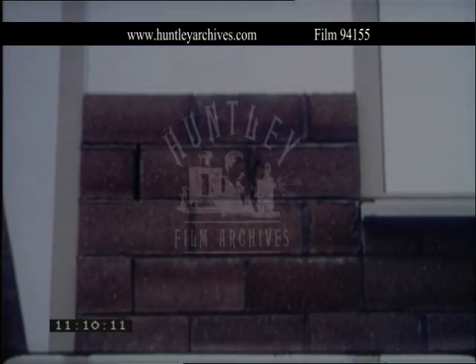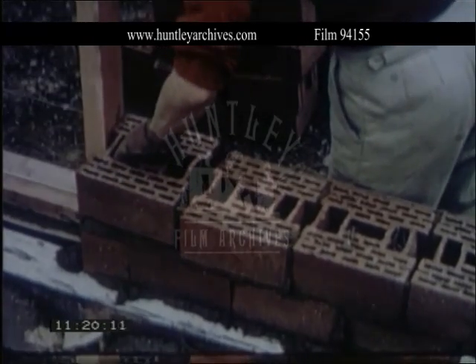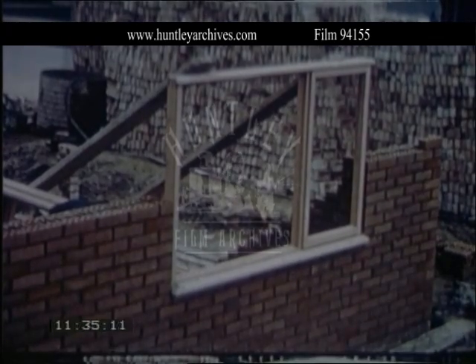Windows and doors were spaced at brick dimensions, using half bricks to complete the reveals. The bricklayers did not have to stop to cut the bricks, and time and materials were saved. This careful planning of walls and openings to brick dimensions is desirable with ordinary bricks to avoid wasteful cutting, but with V-5 bricks it is essential, since with them cutting to size would be even more wasteful.